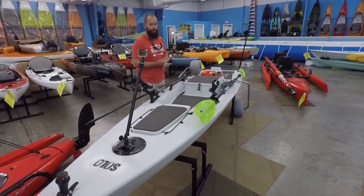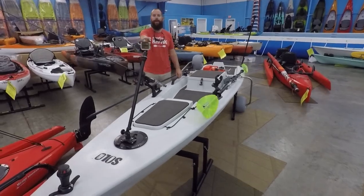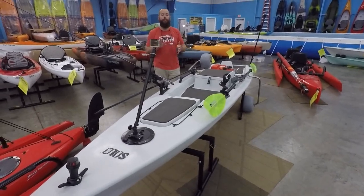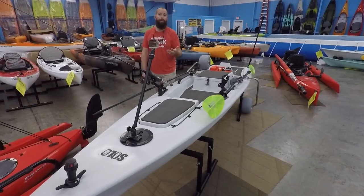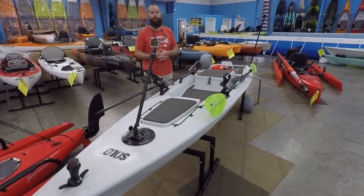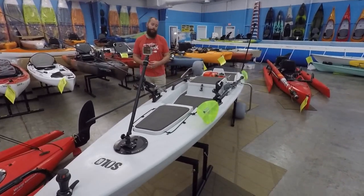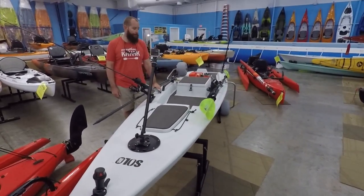Safety — what I'm going to tell you is these lights, the 360 white light and the nav light, are really good options being that they're battery-powered and don't get wired through the boat. It's very simple: either the light's bad or your batteries are dead, and you can pick those batteries up anywhere — unlike rewiring connections where you really need a shop. A lot of these trips are launching at 2 or 3 in the morning or late at night, especially in more off-grid areas.